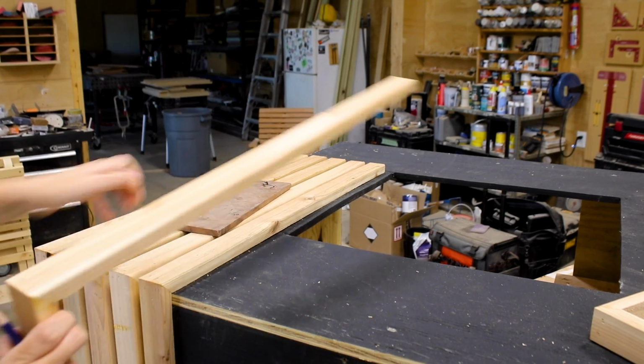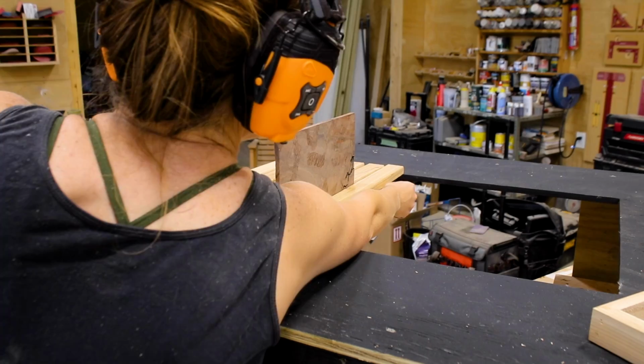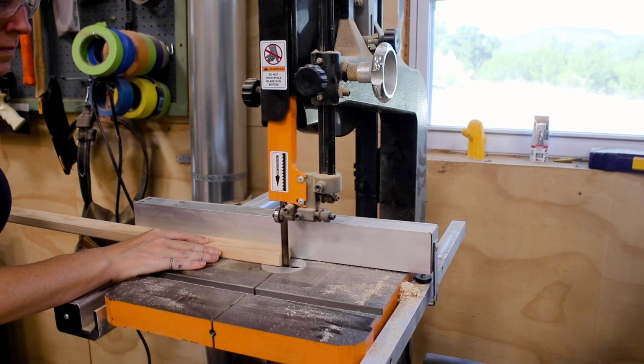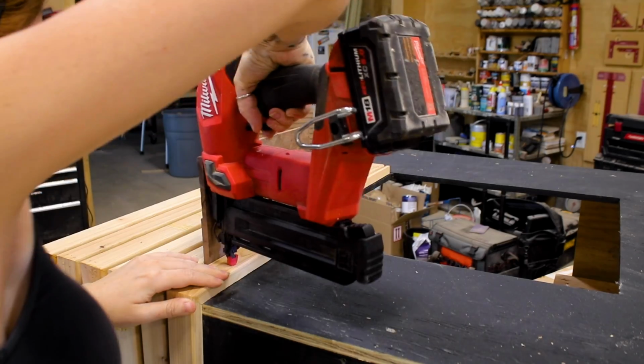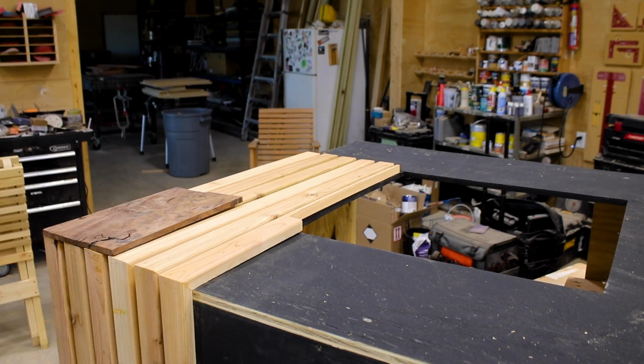When I get to the inside-most slat, I hold it in place so that I can go to the inside hole with the pencil and mark that center hole opening. I think it's easiest to cut this now with a bandsaw, but know that you can also attach it whole and cut it after the fact with a jigsaw or even a flush trim bit with a router. The fire tray is gonna cover it, so there's no need to make this pretty.